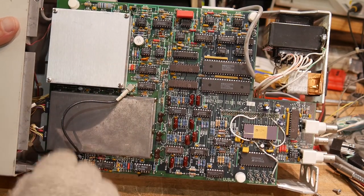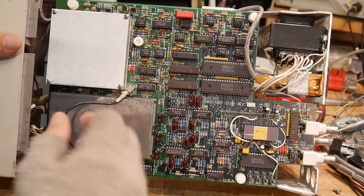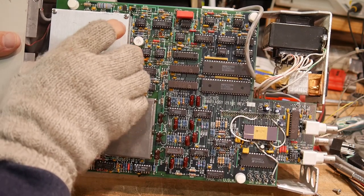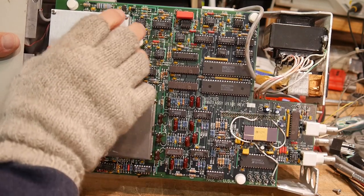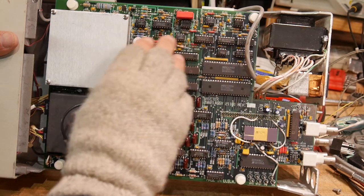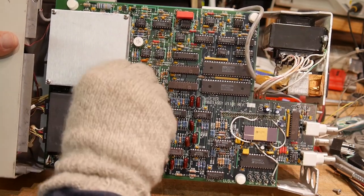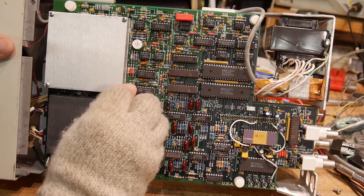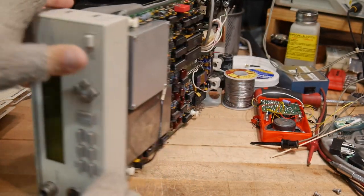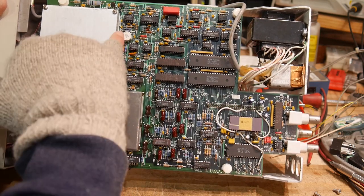This section here I didn't design — I designed everything else. This was a piece of the system already used on another instrument before I got there. This is a 50 MHz calibrator for the power source to calibrate the sensors — I just took the design they had and copied it onto this one. All of this circuitry up here has to do with driving the calibration part. This connector on the front panel is the 50 MHz reference calibrator output.